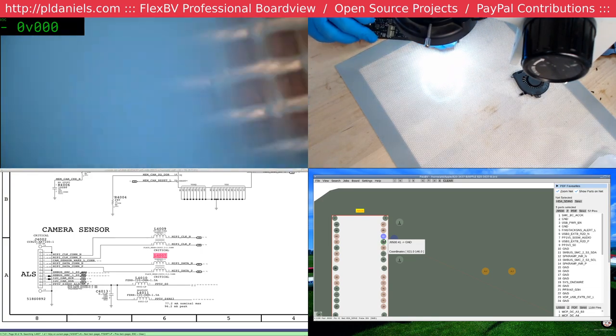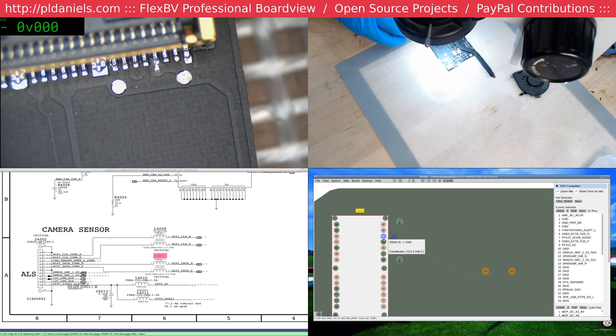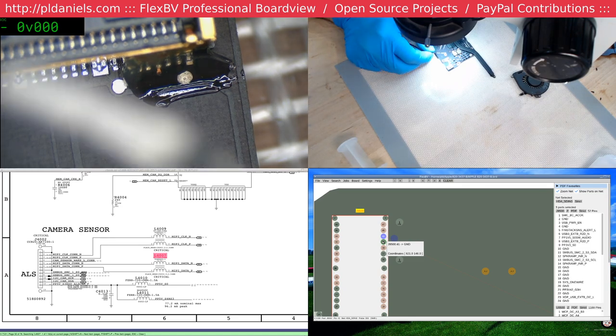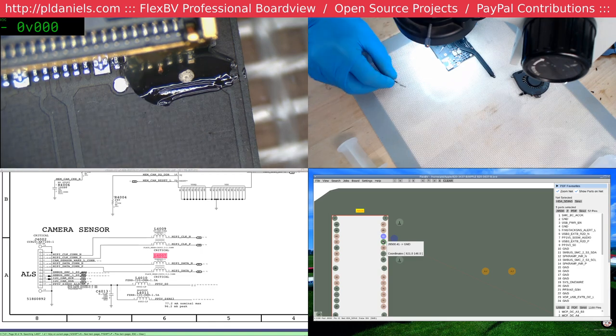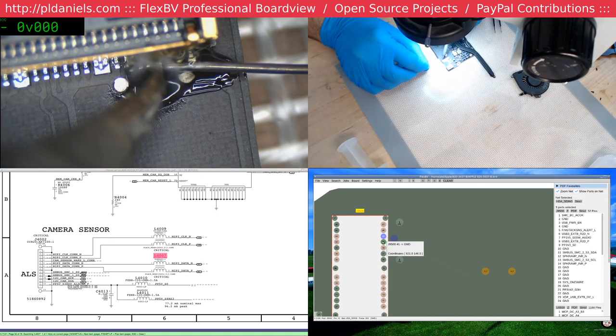Better take my compile solid state stick out. Last thing I want to do is ruin that. I mean, I can rebuild the compile system, but it is such a colossal pain to do so. I should probably put a wire on that as well. And I should probably check all the other pins. Actually, first I'll just put some solder down. The wire is simply going to be for reinforcement. Yeah, the solder blob itself will probably suffice. But the wire, kind of like fiber reinforcement.